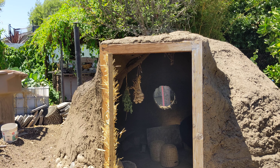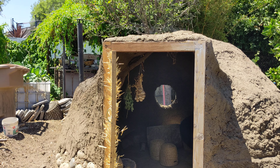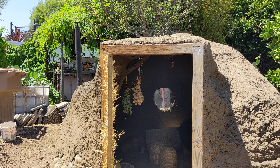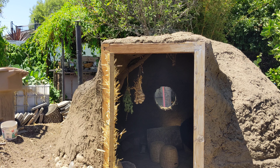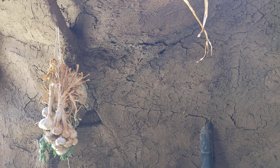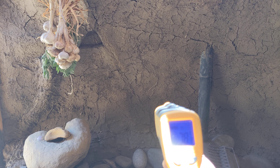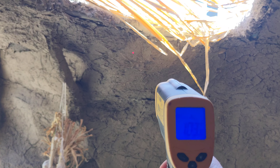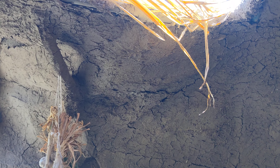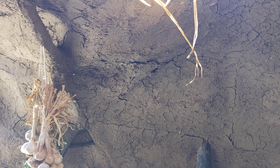This shot is showing you about the height of where the improvements have gone to. We'll measure the temperature on the inside of the fort where it's thickest and thinnest to show you the difference — how much that additional mass makes on the wall temperature. Down at the bottom where it's the thickest, it's 78 degrees, and if we go up to the top where it's still thin, that reading is 101 degrees. So it's about 22 to 25 degrees difference that that extra six to eight inches of mud makes in resisting the heat.